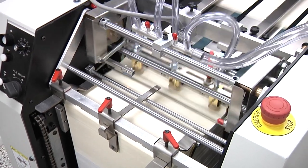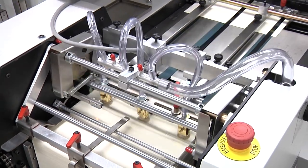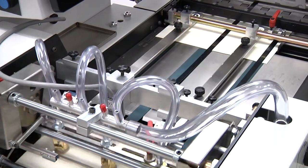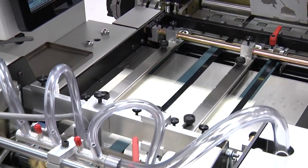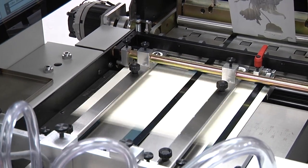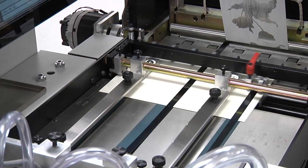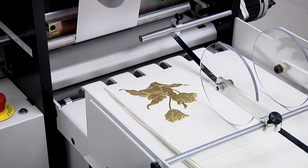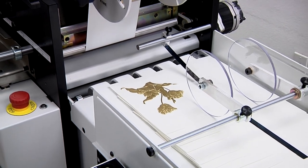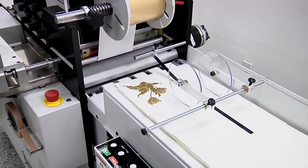Bigfoot suckers feed paper through a double sheet detector onto a registration table. Each sheet is then aligned to an adjustable headstop and side jogged. A sensor confirms the sheet position before a pinch roller grips and advances the sheet into the gripper belts. Precision gripper belts move the paper into the impression mechanism and then eject the sheet onto the delivery conveyor.